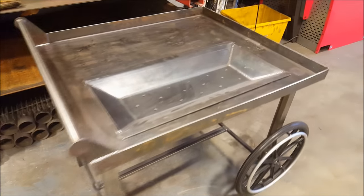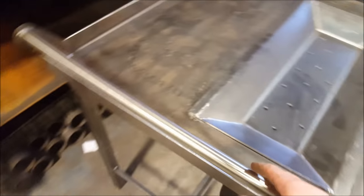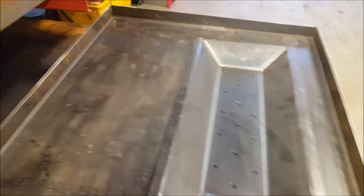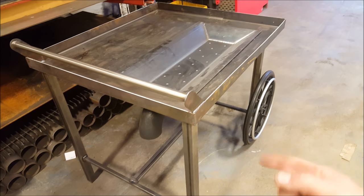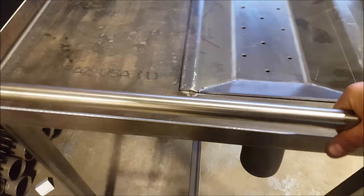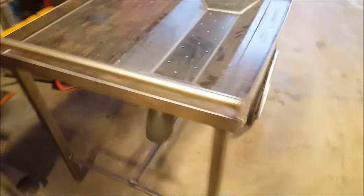Just had another thought while I was wheeling this thing around. Next time, if I were to make another one of these, I would put this tray part going across this way at the end, opposite to the handle. That way when you're forging, this wouldn't get hot, and it also gives you that counterweight so that you don't have to lift up as much on the back in order for it to actually go up on the wheels. Because right now when you lift this up, you actually gotta lift quite a bit of weight to get it onto those front wheels for moving it.